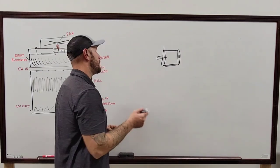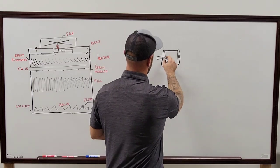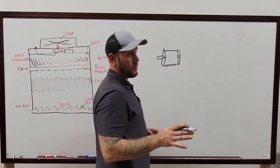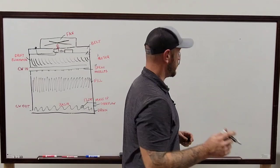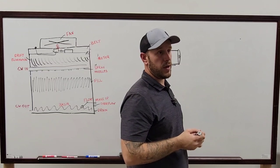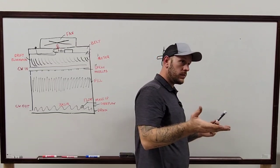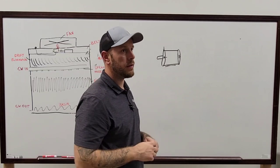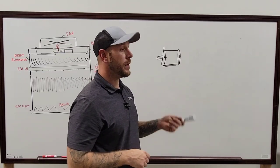The vertical is perpendicular to the base, always. Horizontal is parallel. And axial is always on the back side of the motor, no matter how the motor's mounted, because it's always got feet for you to be able to tell which way you're reading the motor.